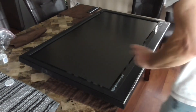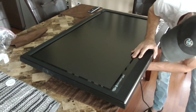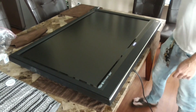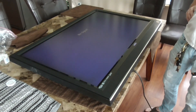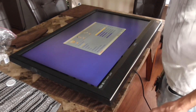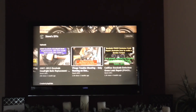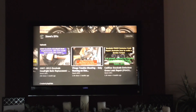So we're all back together, flipped back over — let's plug the power in and see what the display looks like. Fire it up — there's my Vizio logo. Yeah, there we go, no more flutter! So it must have been those capacitors. TV is back mounted to the wall and it looks good — no more flicker, sound and everything works great. All we had to do was change out three little blown capacitors for about ten bucks total, and I've still got three spares left for next time. Thanks for watching!